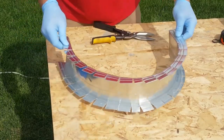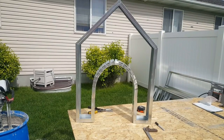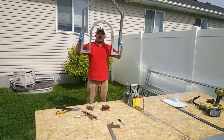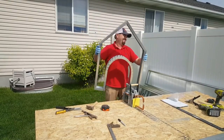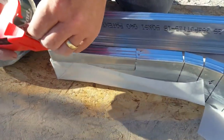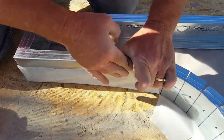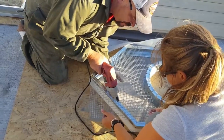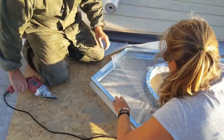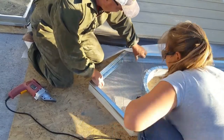There's the basic form with the door for the front end of the doghouse. To prep the forms for pouring, all you have to do is lay them down on a piece of visqueen, then take scissors and cut the visqueen around it — and around the archway since it's a circle you'll put some relief cuts, then tape it up the sides. Mrs. Honeydew and I decided to go ahead and put some rabbit wire or reinforcement mesh in before pouring, so we just cut that to shape and dropped it in.